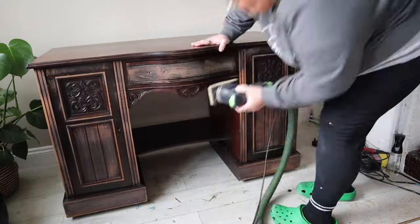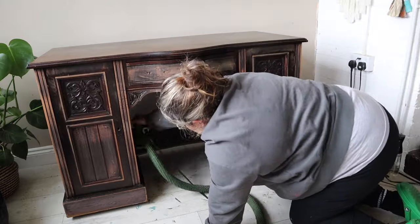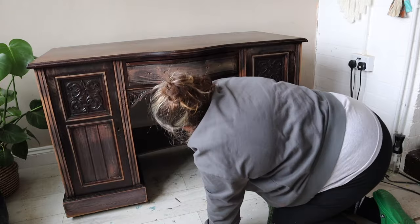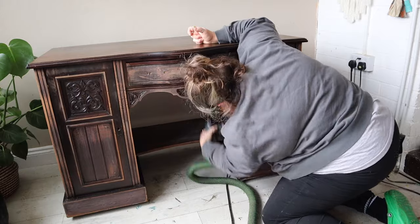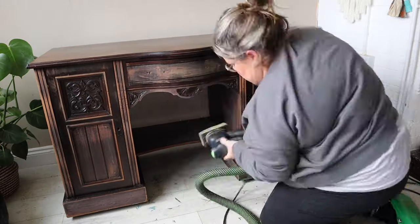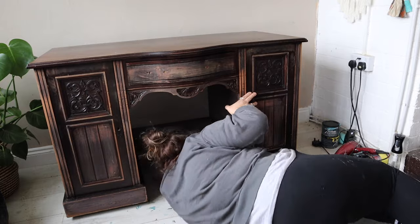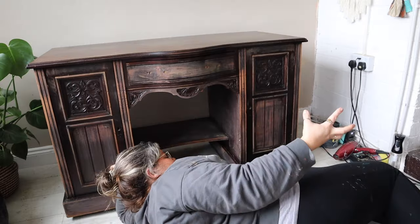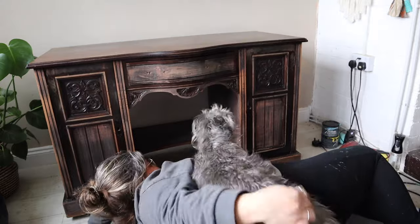And this is simply because all-in-one paints, such as silk mineral paint, which does have that built-in top coat, and the built-in stain blocking primer, they just require a little bit more of a grippy surface in order to adhere to. So chalk paints, chalk mineral paints, those kind of things, they're a little bit more forgiving in terms of what you can paint over the top of. So usually you are okay to just clean your piece with Dixie Belle's White Lightning.